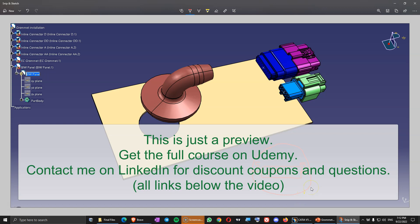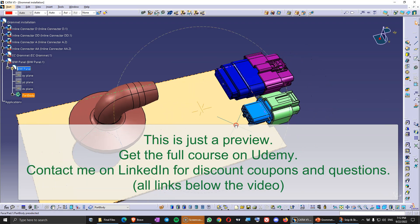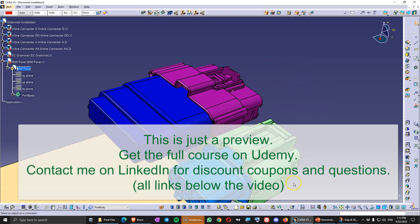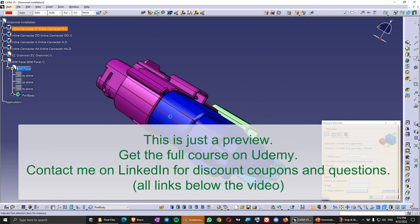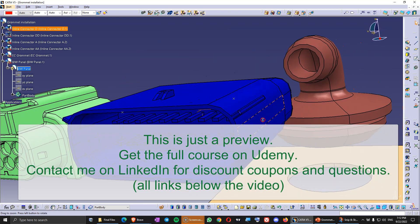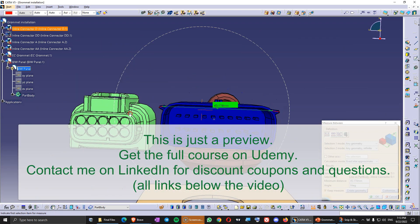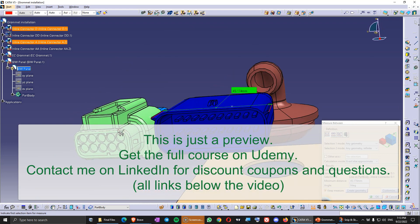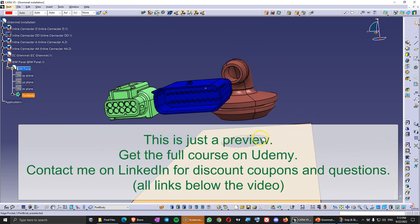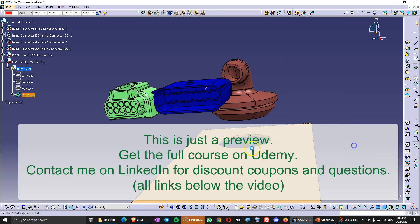This is the hole that you must have, so first you need to check your components and after that find a grommet that will fit in that kind of hole. In this case the component that has to fit through the hole is this part of the connector, which from this side to this side is about 43 to 44 millimeters. If I measure from one guide to the other, we have 45 millimeters. So if the requirement says 5 millimeters on each side — that is an extra 10 — the hole has to be 55 to 56 millimeters minimum. You want to make sure that you respect that requirement.